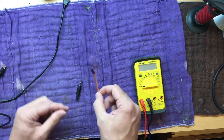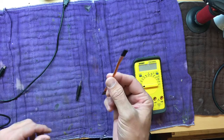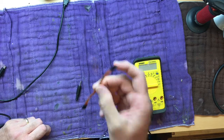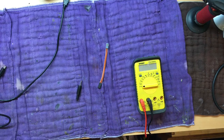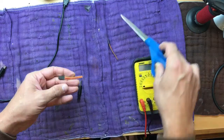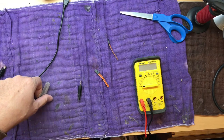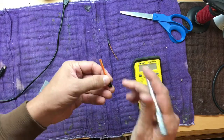And a patch cable. We'll need two male servo connectors, so I've got plenty of patch cables laying around from vbars that I've never patched anything to, so we'll be snipping that in half to get our two ends. So we'll start with that. First thing we'll do is just snip this right in half. So on one of these we only need signal and ground, so we'll be pulling out the red wire.